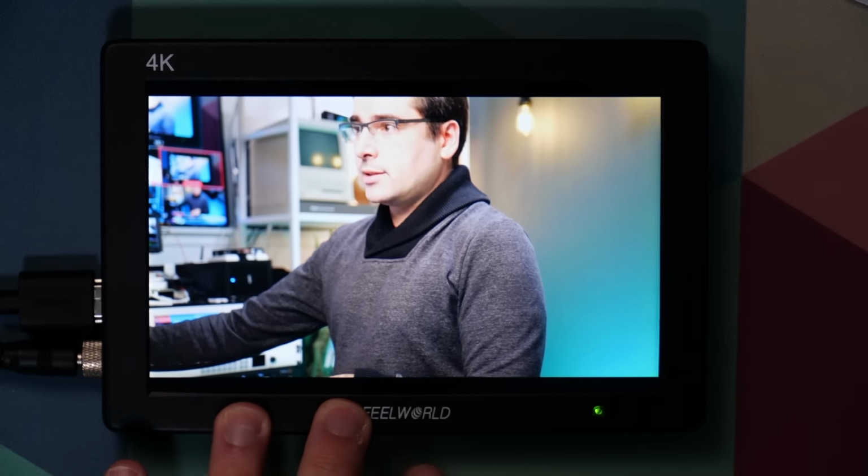One other thing I noticed is that, remember how there are 2 receivers? Well, this receiver on the table is receiving the 4K signal into this monitor, but I still have the receiver plugged into the switcher that I was using to bring in the video into this recording. And since my ATEM is all 1080, that means the receiver is actually downscaling it to a 1080 feed for that. I'll go ahead and patch in the video feed from the wireless transmitter directly into the receiver that's doing this recording. This is the downscaled 1080 version of the wireless feed that was also sent to the monitor on the table. This means you can send 2 copies of your video feed. One can be received by a 4K receiver and the other can be received by something that only supports 1080, which actually opens up a lot of possibilities for how to use this.